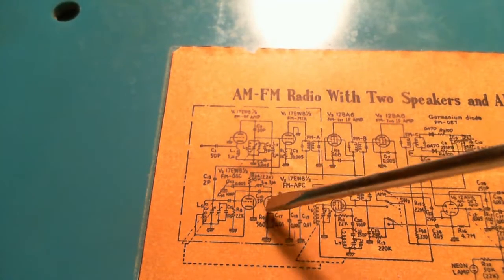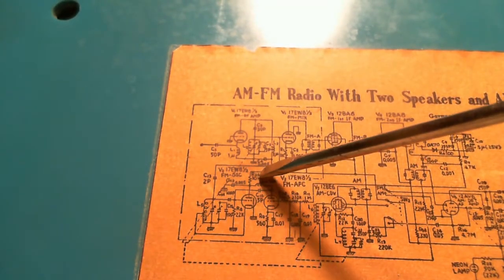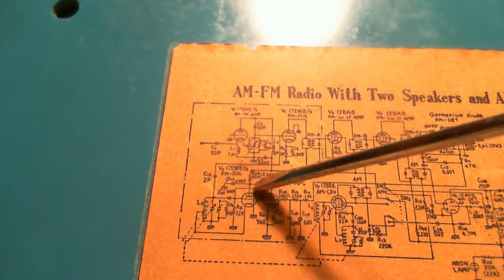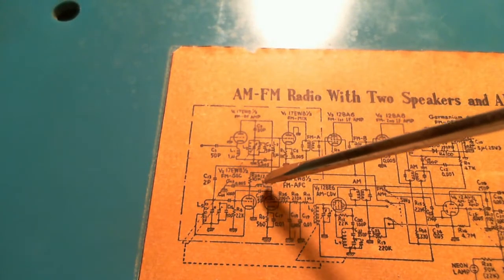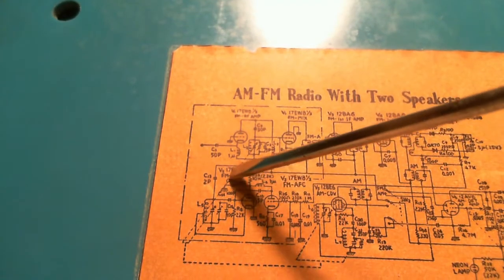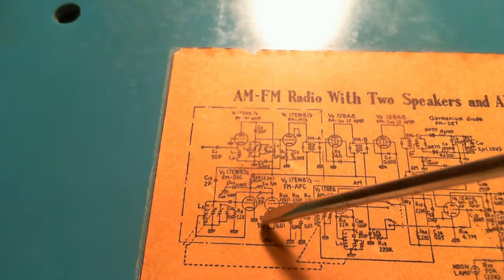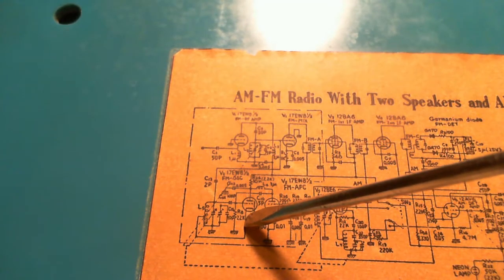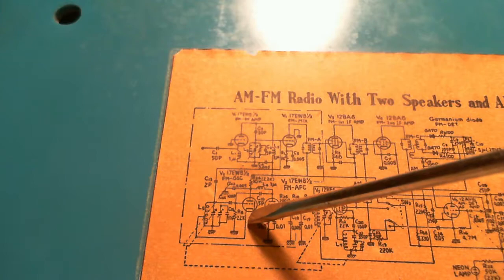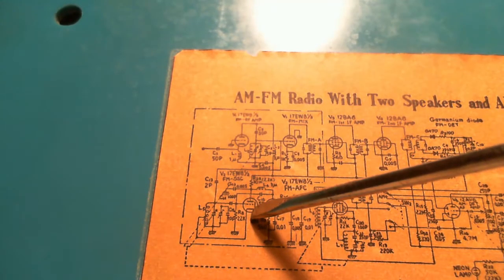The rest of it's a coil right in and the wire right in. Wow, looks like there's one resistor. And what would that do? That would slow the very... No, this is the oscillator. I'd convinced myself it can't be the oscillator because it doesn't sound like the radio is drifting in. It just sounds like it's tuned stably and getting louder.